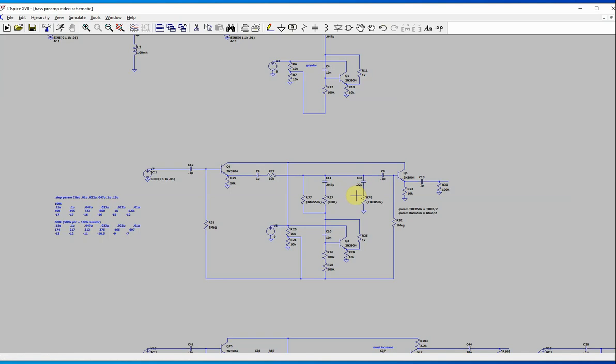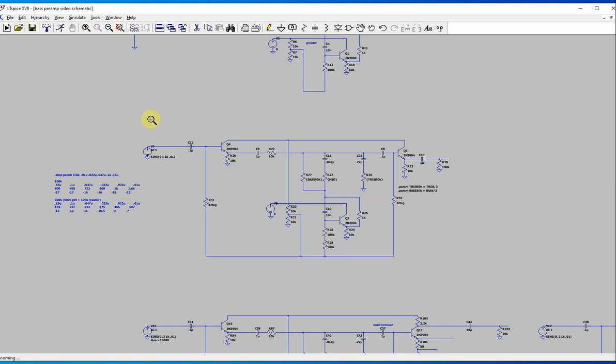And okay, here in the circuit, this is just an emitter follower so that you have substantial input impedance, and then after all this you go into another emitter follower and then out. This is just a load. I do put it on the circuit, but there ends up being a load on that too. So let me just zoom in on this. Sorry if it was out there.